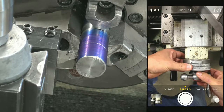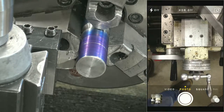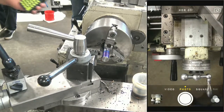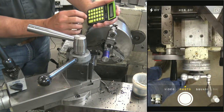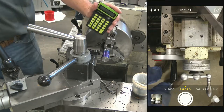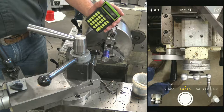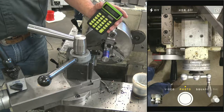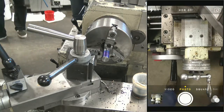Okay, so I'm going to need to go in 3/8 of an inch. Okay, that is 375. So, back out. One time around is 1/4 inch. So how much more do I have to go? I have to go 0.375 minus 0.25 to see what else. Okay, so I'm going to go a full time around and then 0.125 after that. Well, gee, Damon, if I would have broke it down a little easier, 0.25 is 2/8, and I just need 1 more 1/8 to get the 3/8. Math. Okay. Glad I was able to help.